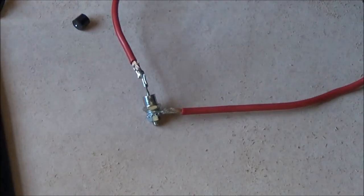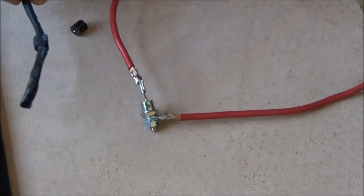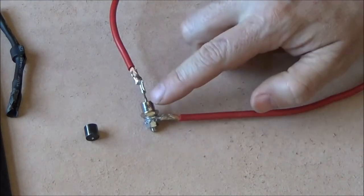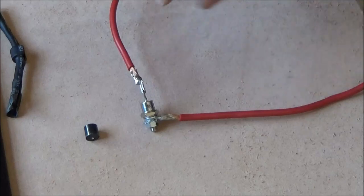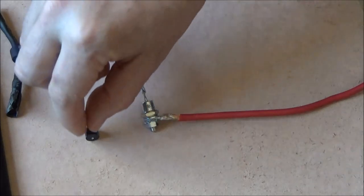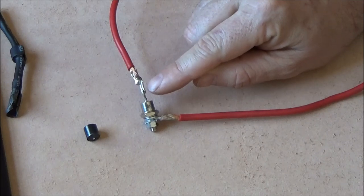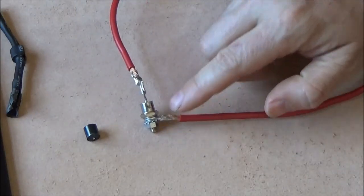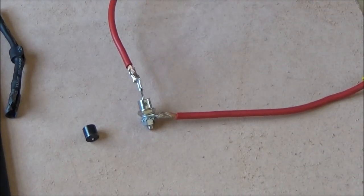I should have recorded this — I did a video on how to check a diode, and I just stripped out the old shorted dead diode and installed my new wind turbine blocking diode ordered from the US. I cut the leads off short, crimped it tight on here — this one conveniently had a little hole drilled through. I took the other lead, curled it around and tightened it with pliers. Now I'm going to tape this up tight so it's protected from shorting.